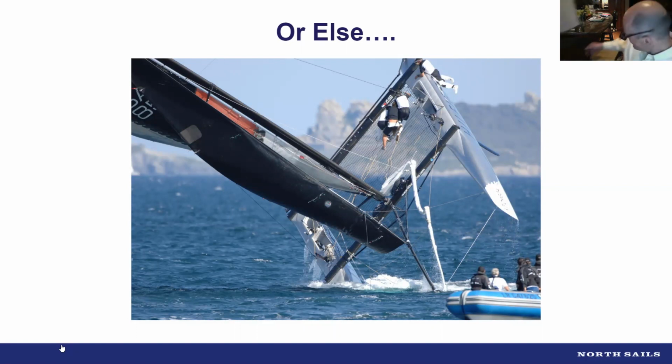And that's one of the aerodynamics. This is what the foiling moths and the kiteboards and stuff do as well, by changing the angle of attack of the wing, vertical over the water versus angled over the water, either spills air or holds air. So a vertical rig over the water, such as what you can get with a catamaran or a multi-hull, is ideal. But to reduce wetted surface and optimize your speed, getting that windward hull just out of the water so it's just licking waves is going to be optimal, especially on the high-speed boats. A good rule for a boat that can fly a hull is if the windward rudder is out of the water, then the hull's flying too high.